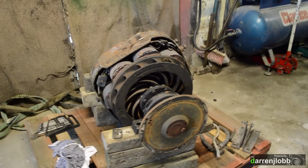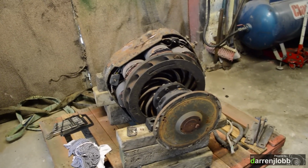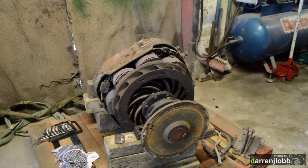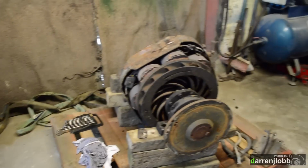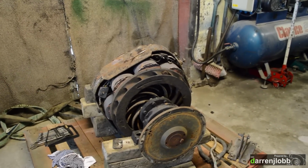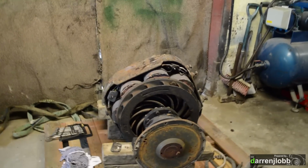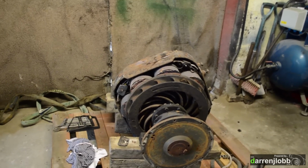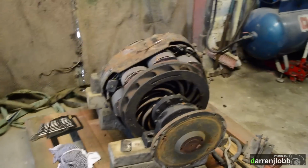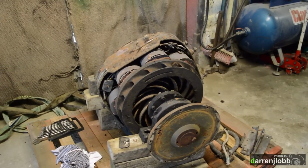For a power run, you can effectively just set a ramp rate in the software, and the computer will then allow the rollers to ramp up at a certain rate by adjusting the load on this via PID. So it's a much more useful and advanced technology, really. Although actually at its heart it's very simple in respect of how it works. Probably more simple, if anything, than the water brakes.